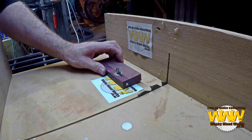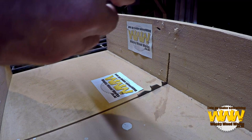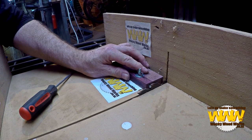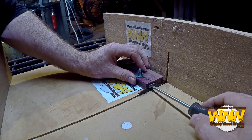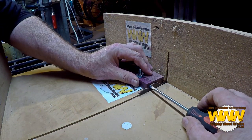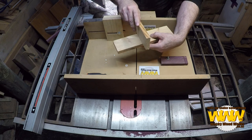Somewhere about there. I've now got my sled set up, and I'm going to set my set screw — have it all set home, so that's even. I'm just going to wind the blade up. I'm pushing that onto the blade and it's a little bit proud, so I'm just going to wind it in. You want it as flush as you can get it. That's pretty good. Now that I've set my set screw, I want to put a dado in there.